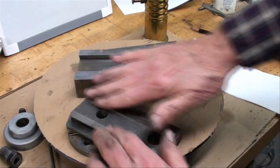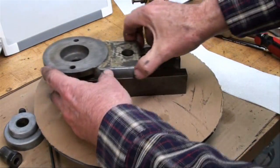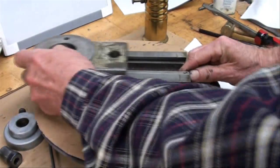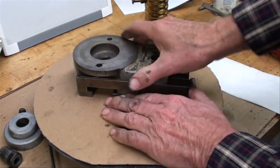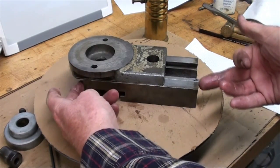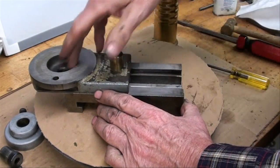This may not come apart again during my lifetime. I'll assemble this carefully — it slides so nice and smooth. Here's the Gibb; I'm going to attempt to insert it. A little tight yet — there. Nice fit, just one little tight spot. I'm going to put those screws in at least finger tight at this time. I have it adjusted roughly the way I want it and will make the final adjustment when it's installed on the lathe with the screw in there, going back and forth.